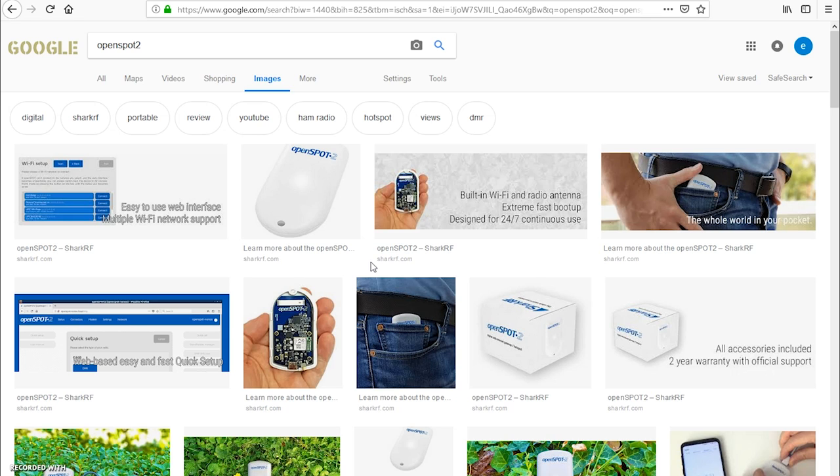Can you use a $60 jumbo spot and do the same thing as an open spot two at $200 something dollars? Well, yes, but the open spot has their own little twist where they have hardware cross mode, where you can set the unit to take your DMR signal and turn it around on D-Star, DMR to fusion, and fusion to DMR. But then PiStar has implemented some of that where you can go fusion to D-Star or fusion to DMR, DMR to P25, different cross modes. Not all of them can be cross-moded, but a lot of them can. They find something that the users want, they add to it, they modify it, and they try to make it better. But the soul of it — the hotspot is doing the same thing.